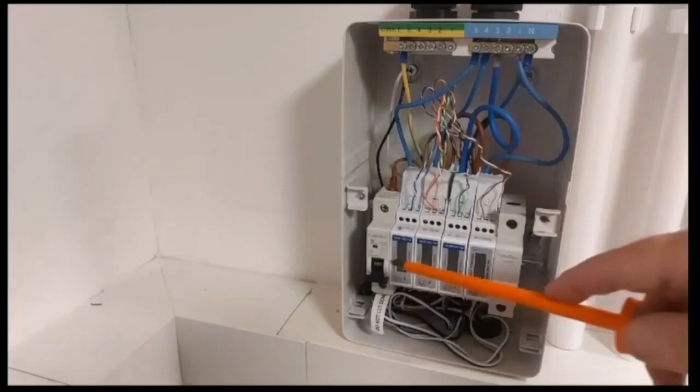I've used all the pairs in the Cat 6 this time. Even though meters 3 and 4 are going to the same port - port 2 - it's just as easy to do all the wires up at the EMS or at an inverter, because the socket on the EMS or the plug on the inverter is a lot easier to wire up. If you make a mistake, it's easier to pull that plug out, have a look and test, rather than going back to the meter. Start at the meters wherever possible.